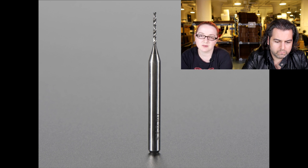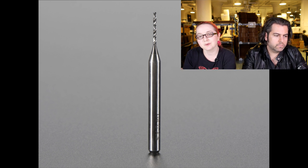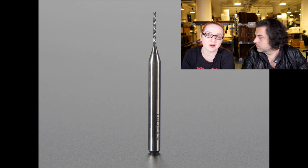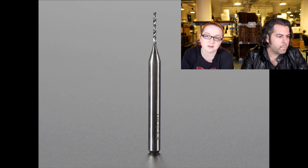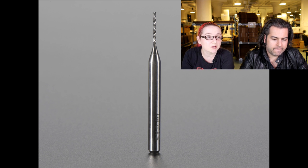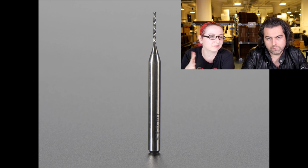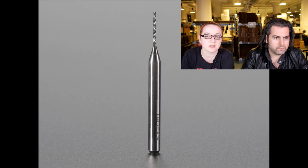They do have a 5 or 8 millimeter long cutting edge, which is a little bit long, but they're also really low cost. So even though they're not as short as I'd like them to be, they're a little bit more liable to break than the short ones. We haven't had any breakage issues. Honestly, when we cut PCBs, they get dull before they break because you're cutting through fiberglass or copper. We find that they're good for like 5 to 10 hours of cutting before they need to be replaced. But at $4 each, we can cut like 5 or 6 PCBs and we replace them.